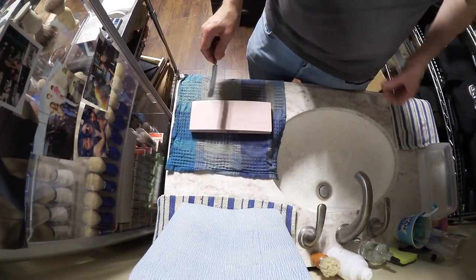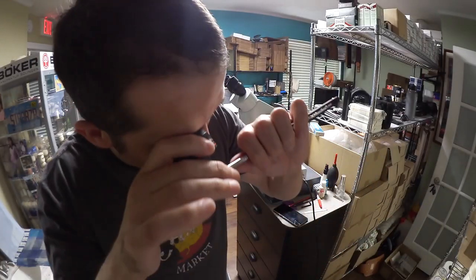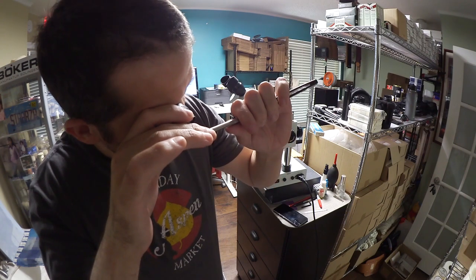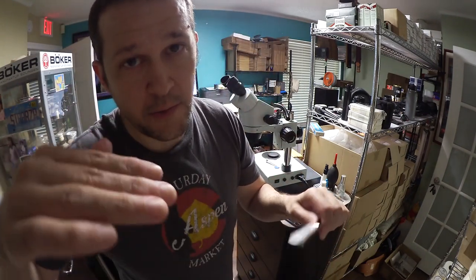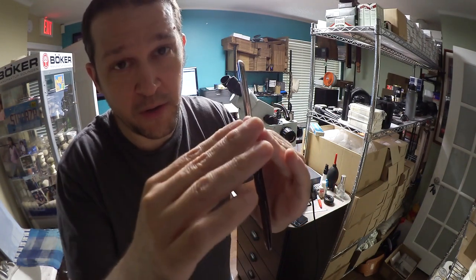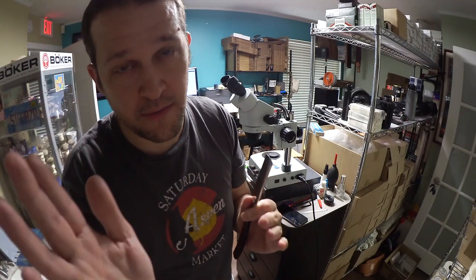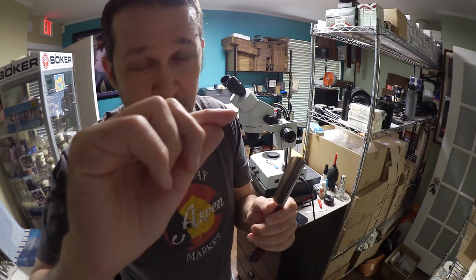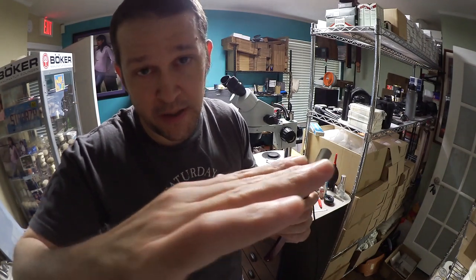That step is going to take probably 15 to 20 minutes. Pretty hard steel. I've been at it about 10 minutes. Are we at the point where the thinning stone has gotten the most it can get? Now, when I use my 8X loop, I really only see one scratch pattern, and I can't tell whether or not the thinning stone has taken so much from the bevel that what remains from the spot you can see with your naked eye till the ending, when that gets really thin, it just flexes to the curve of the stone. And when that happens, you'll start to have contact on the apex from your rougher stone, and the naked eye line is still making progress toward the tip.